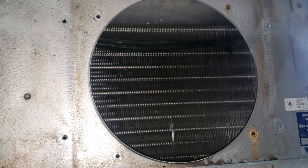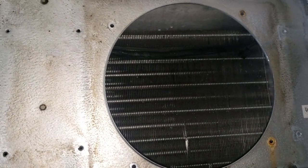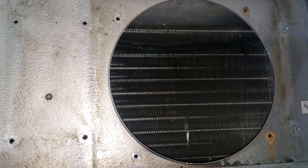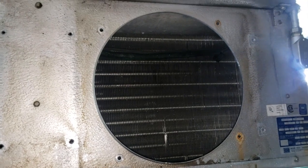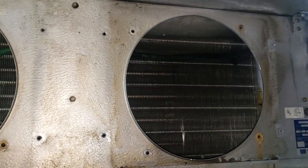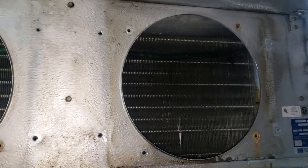And this thing, they have no ability of turning off the power downstairs. So that defrost clock should have the right time. And it said like 2 p.m. when I got here at 8 a.m. So it's definitely something going on there. So we're definitely going to change the defrost clock, but then we're going to check everything else out.